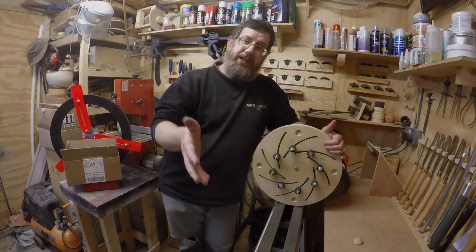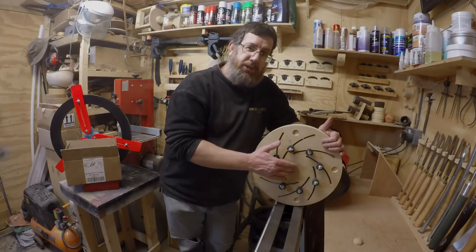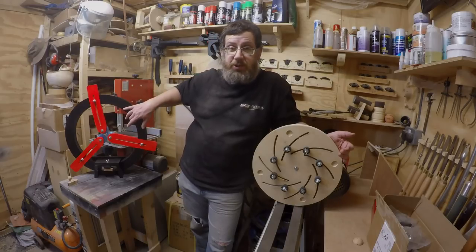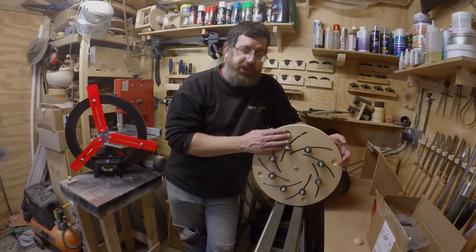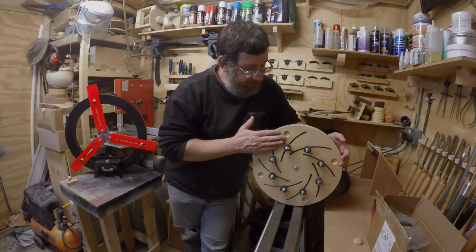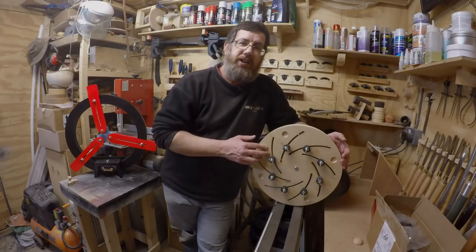The long bolt running into the Jacobs chuck on the tailstock works absolutely fine. The only thing I might do in future is upgrade the current 6mm centre bolt to an 8 or 10mm bolt for more strength and less flex in the Jacobs chuck. This was an ideal project to make after the steady rest, since the discs are the offcuts from that build — effectively reusing scrap wood. I don't intend to paint it because you don't want paint transferring to the surface of a bowl. I might give it a coat of wax just to protect it, but definitely no paint. Thanks a lot for watching and I'll see you in the next project video.